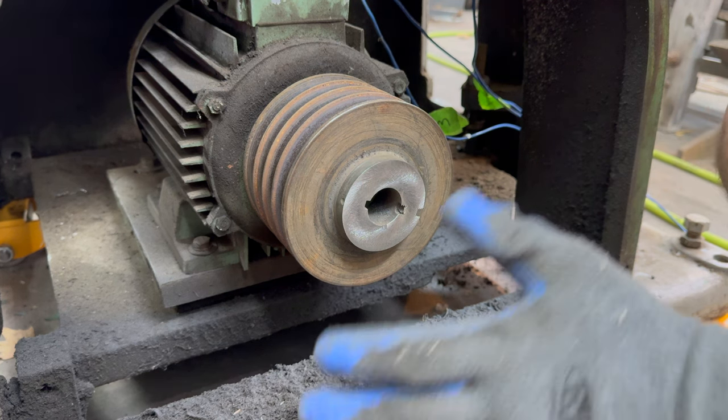There are some wipers. These are rubber. These are felt. I'm not sure. So these have contracted. These parts at the tips used to touch the ways or the bed. They have since kind of receded. They're no longer doing their job. I think I might replace those with felt. I have rubber, but cutting it to fit, I think, would be just kind of a challenge.